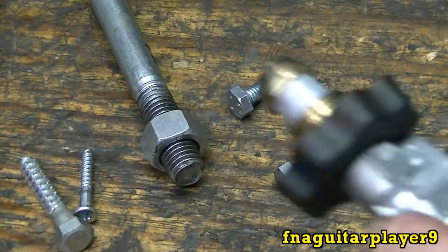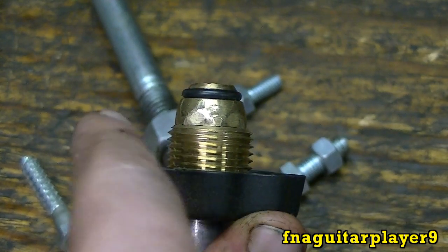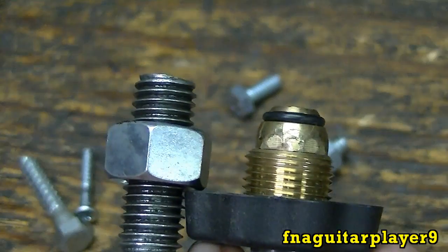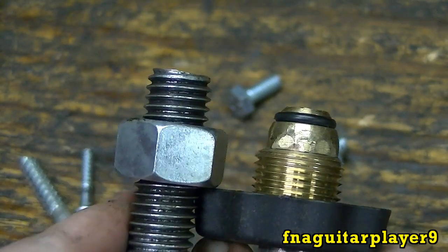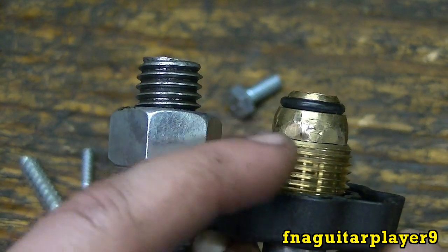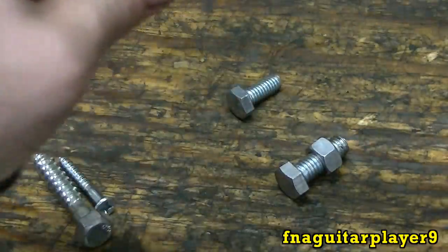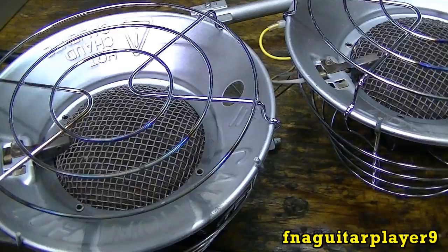Another common use is a gas fitting. You can see it's slanting uphill from the right to the left, so the left side is up — you know it's a left-hand thread. You can see the difference here: this one slants up to the right, this one slants up to the left. That's how you memorize it — if the right side is up, it's a right-hand thread; if the left side is up, it's a left-hand thread. This hose here is off my double-burner propane heater.